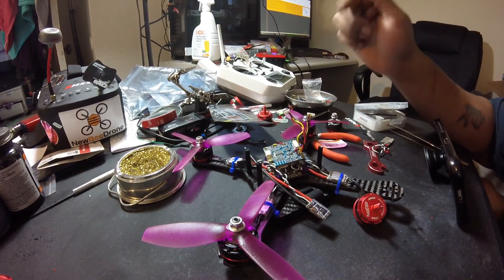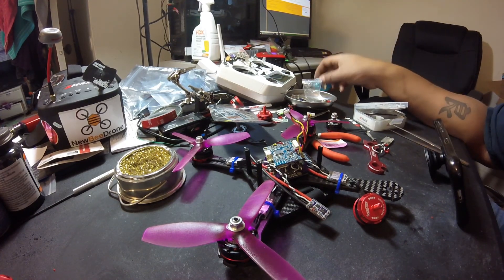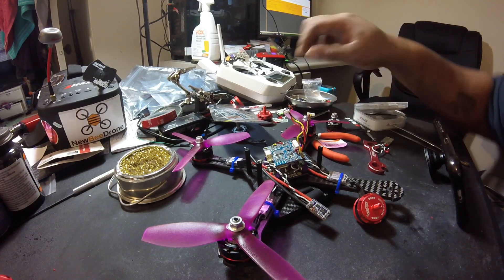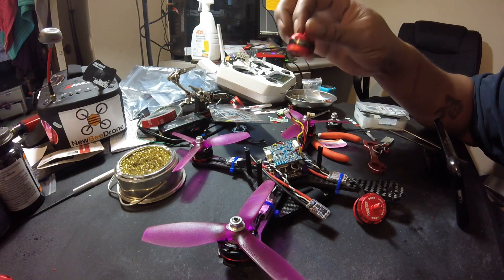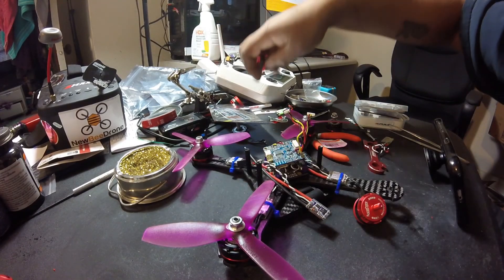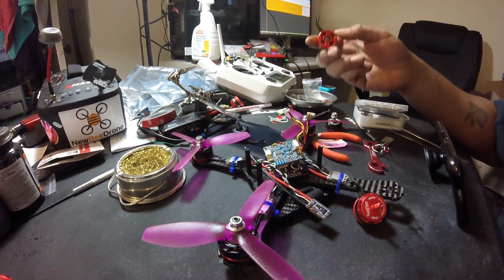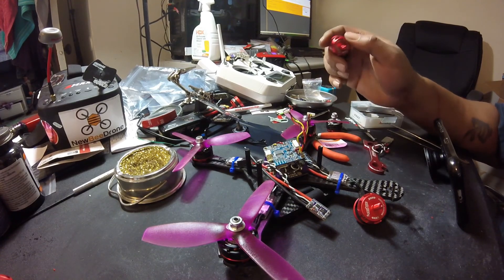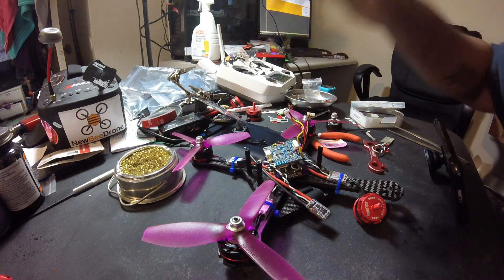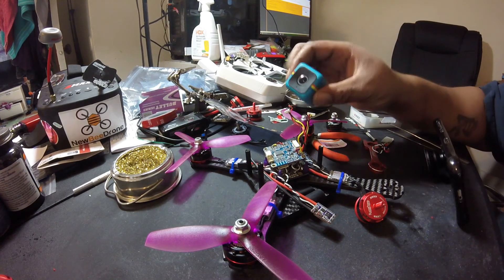Hopefully what really happened was the prop nuts were loose and I was just giving it hell. We'll slap this stuff on there and then we're going to go out and maiden it again. I did some looking yesterday — I wanted to see the thrust numbers of these Racer Stars 2205 2300 kV compared to the EMAX Bullets Red Bottoms. On the low end the Racer Stars were making about 500-something grams, and on the high end I'd say 900. Whereas the Red Bottoms were coming in no less than 1,000, almost maxed at 1,300. Of course that's for different prop variations, but I don't think we're going to have a problem carrying the camera this time.